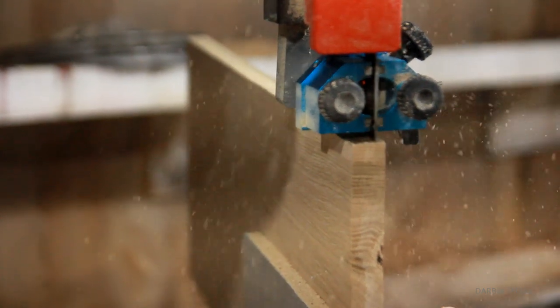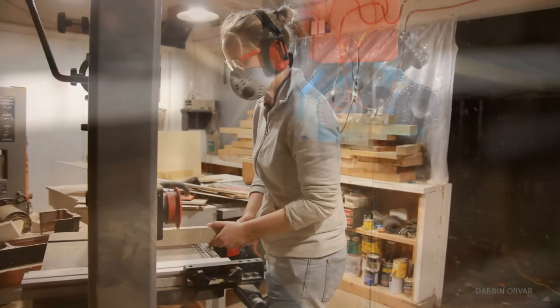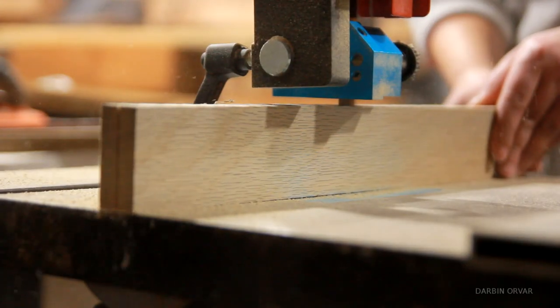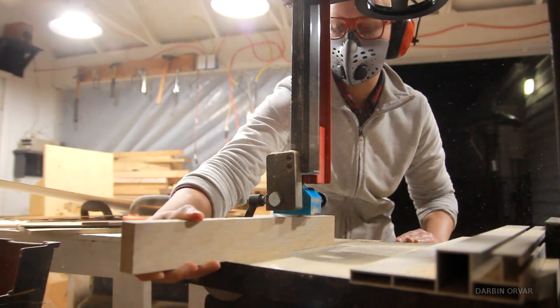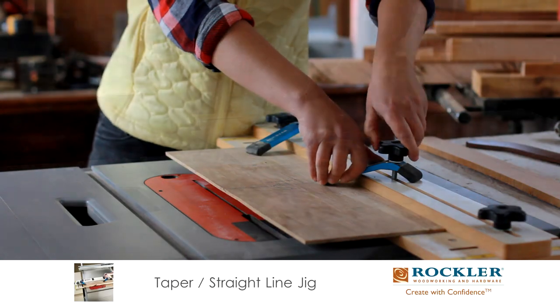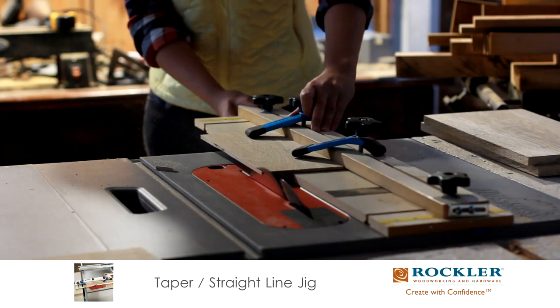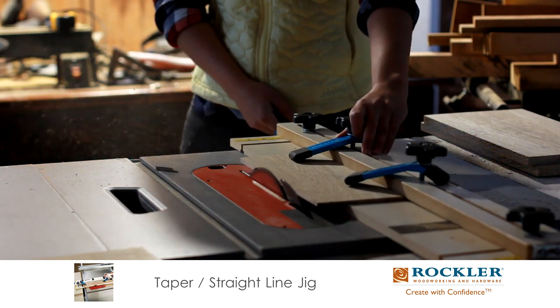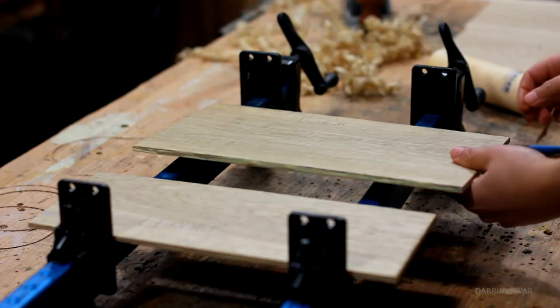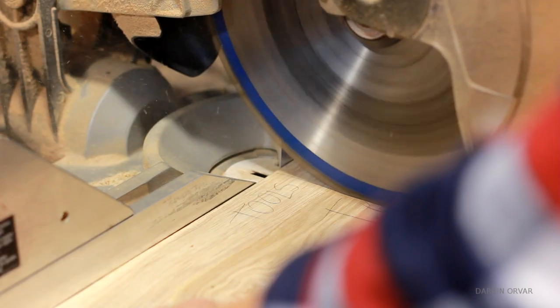First of all, I did a lot of milling to get this wood to size. I re-sawed it on the bandsaw, and I didn't want the wood too thick — I was going for about 10 millimeters or 3/8 of an inch. Here I'm using the jointer jig for getting clean edges to glue up panels, as well as using a hand plane. A lot of this box is gluing up pieces for panels and just cutting everything to size.